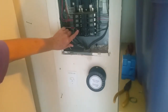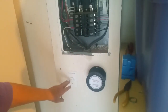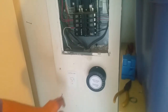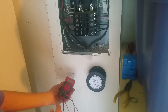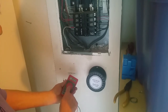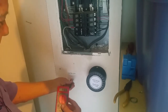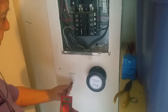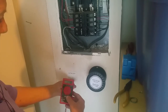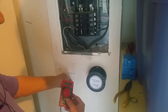We can go ahead and turn on the power, and now we should have 220 volts here. I'll show you how to test it with a voltmeter. Get your digital voltmeter — you can buy these for under $20. Power on, set to AC volts, ACV 750. Take your probes, plug it in — 240 volts. And you can double-check between each pole and ground: 120 on that side and 119 on that side. So that's all perfect.